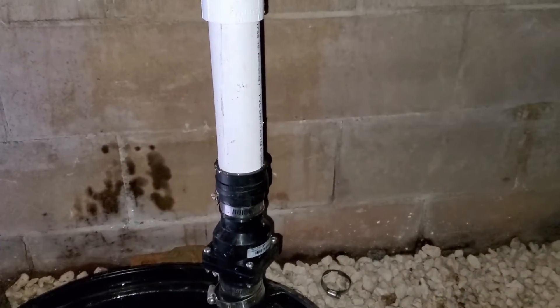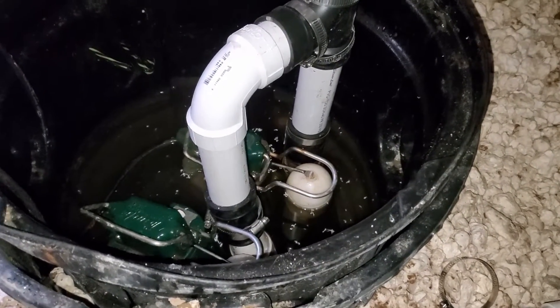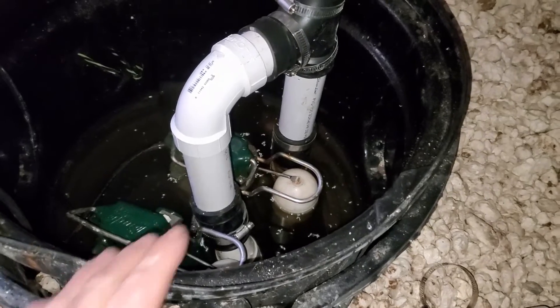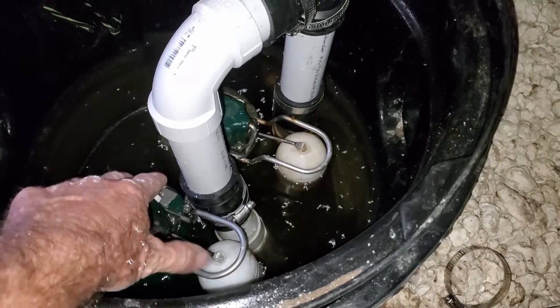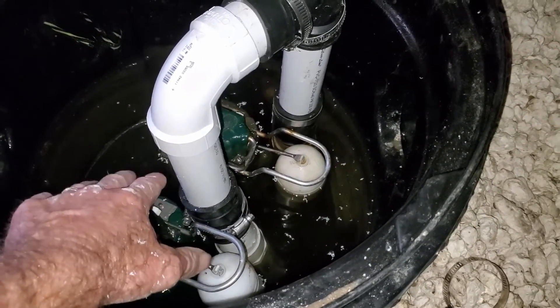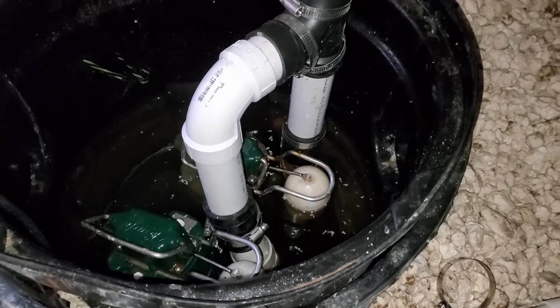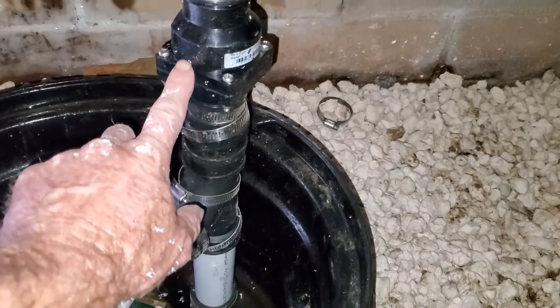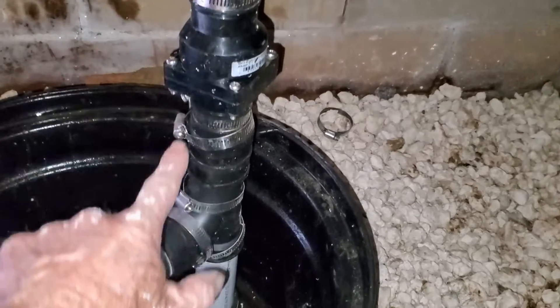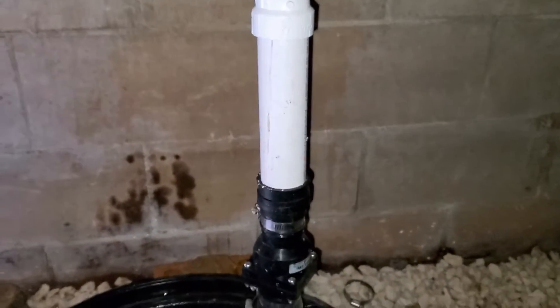Let's take a look so you can see. We've got two Zollers down there — you can see that water filling up, that's why I had to work quickly. One is the main pump and we've got the backup pump over here because this job was below sea level, so a lot of water gets into this crawl space. We've been able to keep it very dry. What we're trying to do is solve that noise problem. We put one check valve in line, protecting both pumps, re-plumbed it, so we go out through with discharge. Let's secure it and glue it up and give it a try.